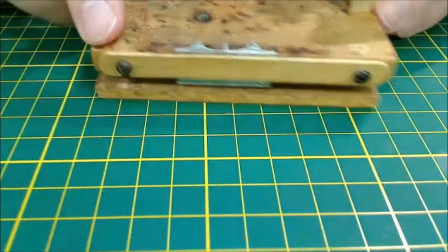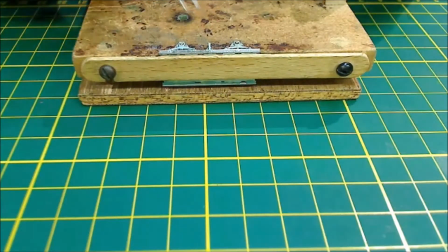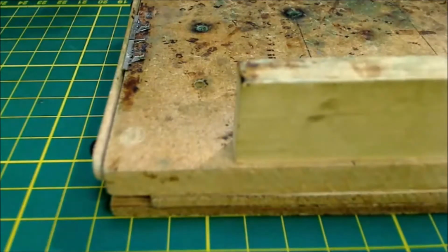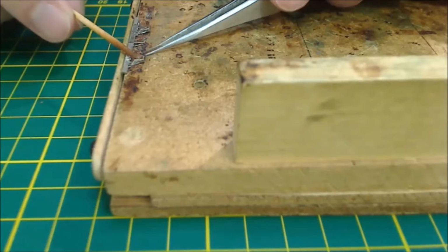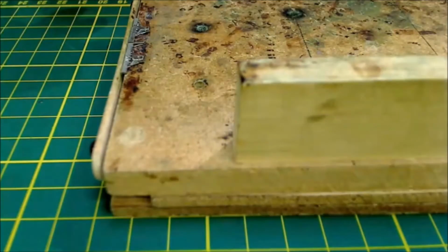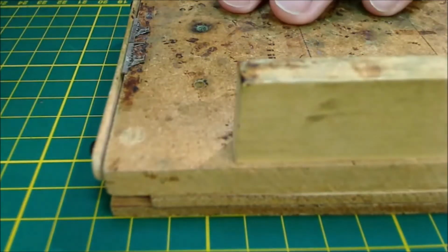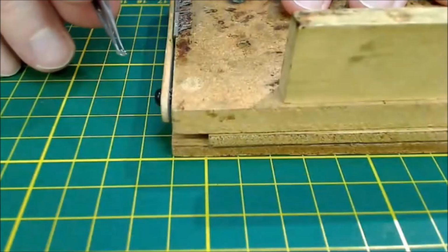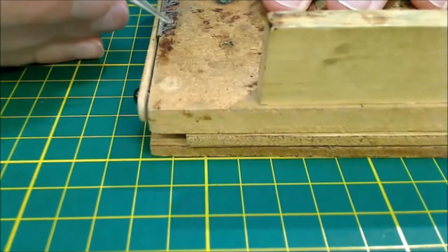So if I bring in the chassis on my Orion jig now, what I need to do is align this over one of these axle boxes. So again, flux, and because this flux is sticky, it'll help things stick in place. Remember yesterday, we filed off the turning pips of the axle bearings, so they weren't going to stop the axle box sitting down. If you can see the inside of this, probably not in focus, that bottom layer with the hole in it is now a dimple, which will line up over here.